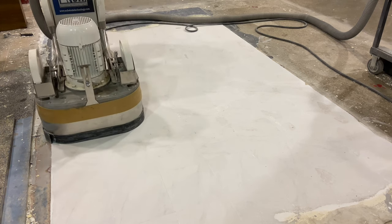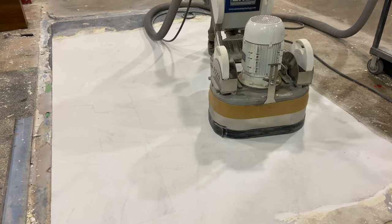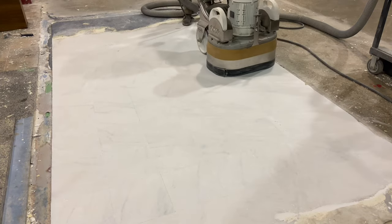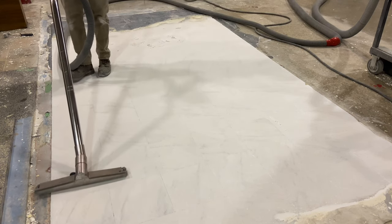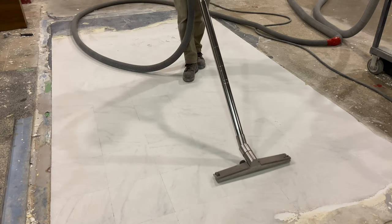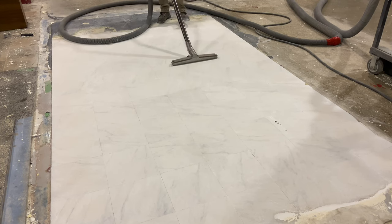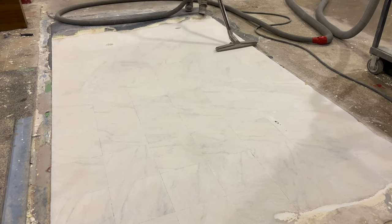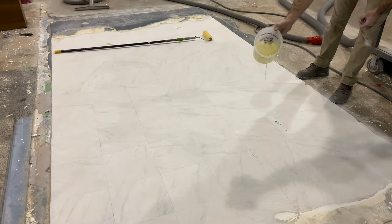The 70 grit is used to further process the surface, almost like polishing, but the floor still has enough abrasion to provide texture so that the coating can stick and, through absorption, achieve maximum adhesion. The final step before coating is vacuuming. This floor can't be shot with plastic because the coating is so thin, but it can be vacuumed thoroughly to remove all dust so the coating will absorb with nothing between it and the floor.